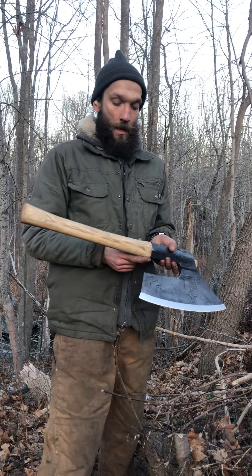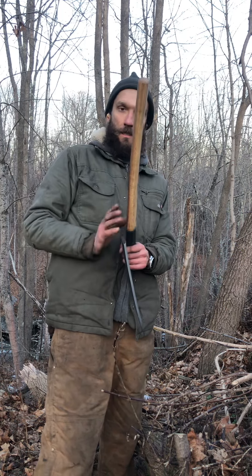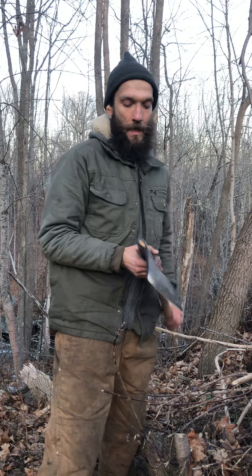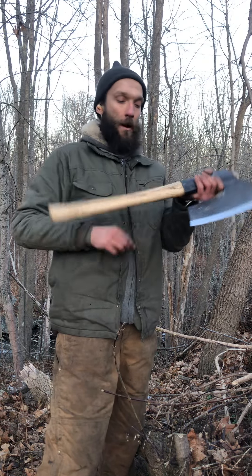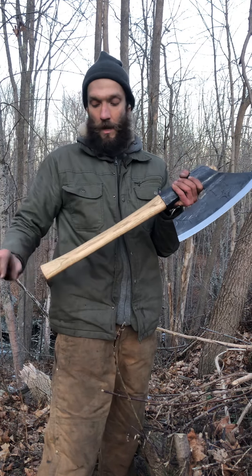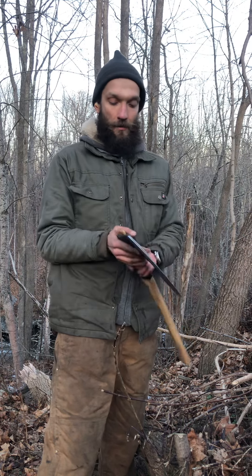The handle, as you can see, is a really cool piece of wood. This handle with its cant to it allows you to get your hands out of the way as you're hewing a beam. But this was not steam bent — this is actually from the bell, or the base, of a hickory tree where it grew out of the ground, and it just had this wonderful natural curve that I was able to utilize to do an offset handle on this thing.